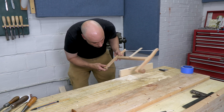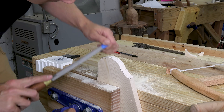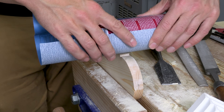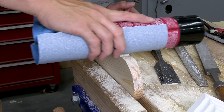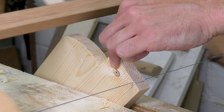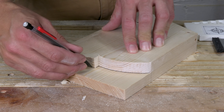These details are easy to cut out with a turning saw and a back saw — or a band saw if you want. I saw outside my lines and then clean up with rasps, files, and a spokeshave anywhere it will fit. The spokeshave goes fast and leaves a clean surface because it slices the grain. My favorite trick for finishing off inside curves is to wrap sandpaper around a spray can — easy to handle and leaves a great finish. The sides are just as simple. I saw out the two curves, and my turning saw even cuts right through that knot without splintering. I took my time cleaning up the first cut and then traced it to make the second side so they're identical. All the parts are cut and I'm ready to assemble.